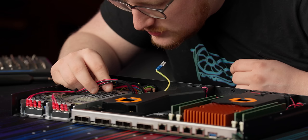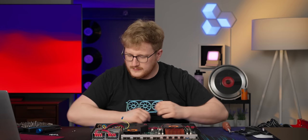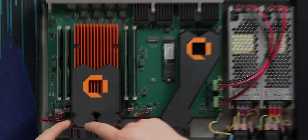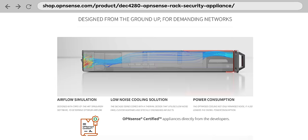12 volt at 16.7 amps — that works out to about 200 watts each. I see what they mean about optimized cooling. They made their own 3D-printed airflow components — why does it have that shape? Does it reduce turbulence or something? On their product page they have a photo of the airflow simulation, the fluid dynamics, and it looks very smooth. They're 93% efficient power supplies.